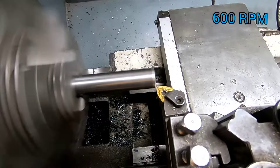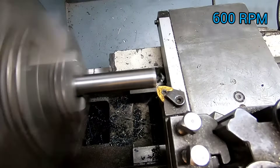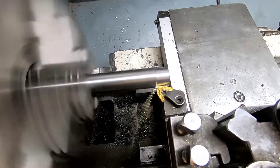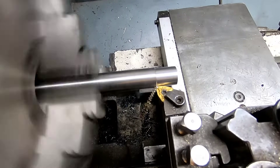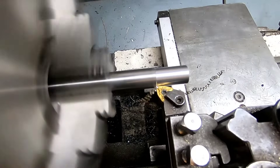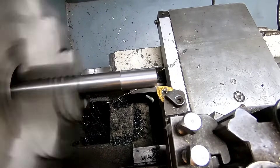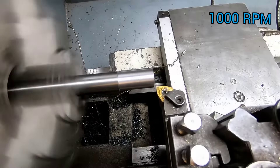Now that we got that hole drilled, we're gonna turn the outside diameter probably about an eighth of an inch oversized from what we need. The reason for being quite a bit oversized is simple — once we heat this up with a torch we're probably gonna distort the metal a little bit, and we don't want it wobbly on size because there'd be no way to clean it up.